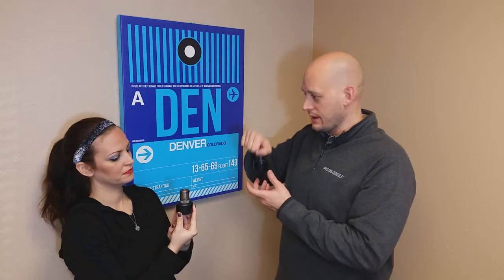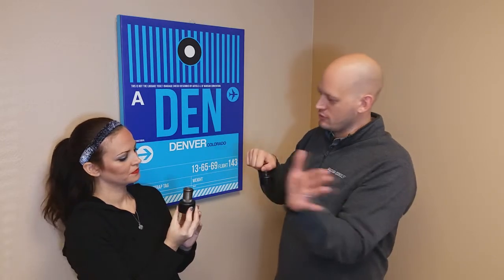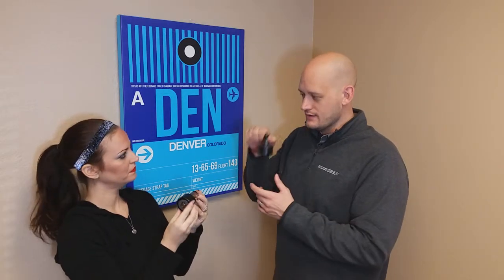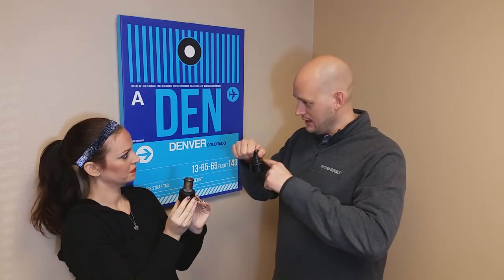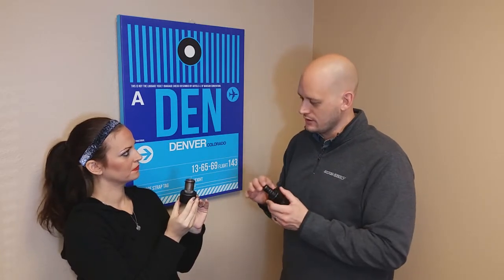It's fixed into typically a link weldment and occasionally a pallet support. When it does that, it's maintaining that perimeter shape and keeping the crescent pallets or the stainless steel pallets in line with where they need to be. The other function is that because it's very strong and made of steel, it can be engaged with the drive chain — the drive chain hits it and drags it along, which propels the link weldments forward, like on one of the transi-tread style carousels. That's a typical use of this product.